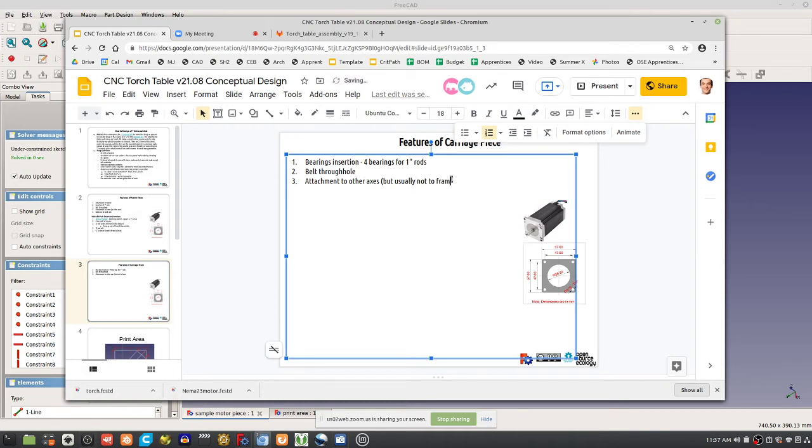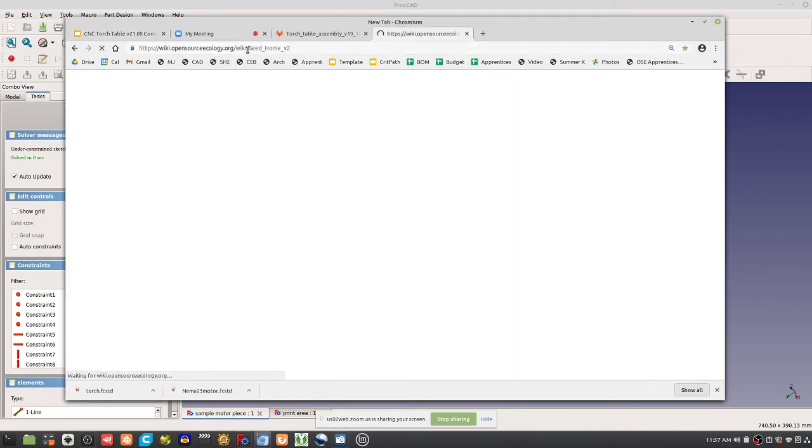What would be an application where you mount the carriage to the frame? Well, all you could think about is that the carriage is stationary and the two ends are moving. For some applications, like a pusher, like a poker, that you're automating, you're fixed on the frame, but the axis is used as a pusher to push something over, for example. Anyway, what else do we need? What else does the universal axis have?